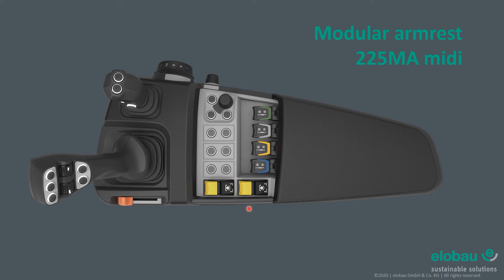There's also a big choice of symbols in the online configurator. You can see the PTO switches — one for the PTO function of a tractor and another that could be used for the park brake function. With the fingertip joysticks, hydraulic functions of attachments are typically controlled. There are also additional controls: a hitch wheel for height regulation of an attachment and an additional potentiometer. You can see it's really a lot of functions — you can control every function of a tractor. With this armrest, it's possible to summarize everything in quite a compact way while still having a clear overview of the functions.